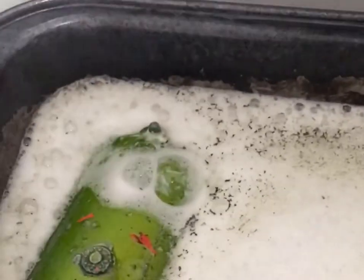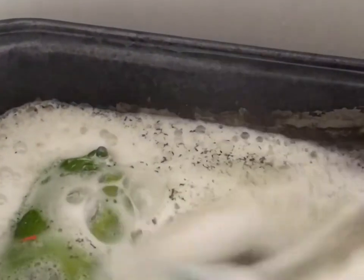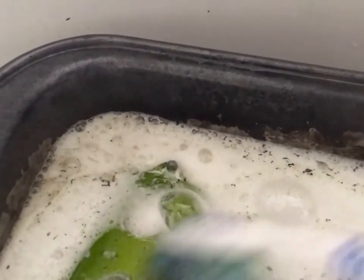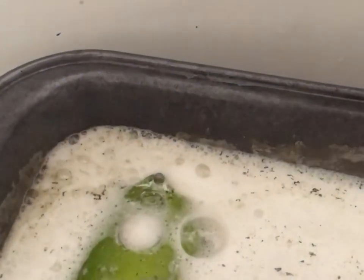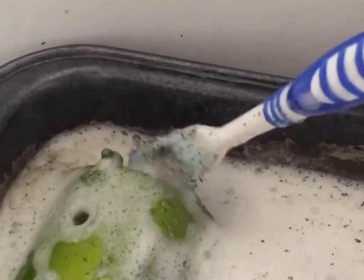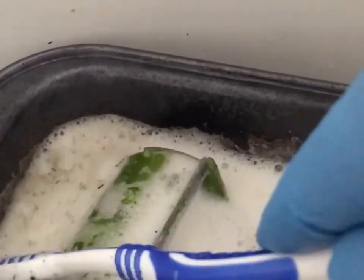Oops, that's a really bad angle. As you can see, the fizz in the water, I'm thinking, oh yeah, it's all working fine. The fizz, and you can see there, is the caustic eating away at the glue or whatever was keeping on them two cogs on the axles. I was unaware at this time, but that's what was happening with the fizzing, and that's what caused the two cogs to slip off the axles, because there was nothing there to keep the adhesion going.